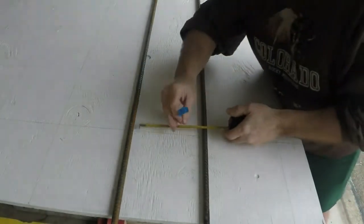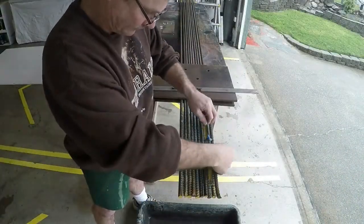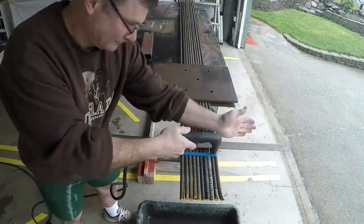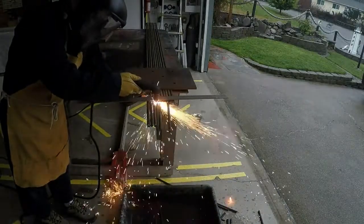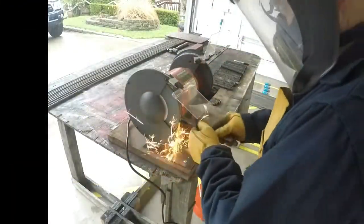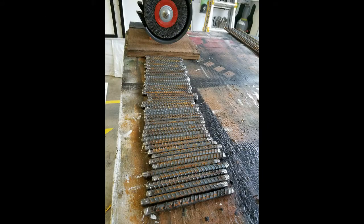It's time to cut the short rebar. Instead of actually reading the tape measure, just put a piece of tape on it where it's supposed to be — no error possible this way. Then lay out 10 sections of rebar side by side. Transfer your tape mark over the rebar, line up your straight edge for your plasma cutter, then let the sparks fly. You'll actually be surprised how quickly you can cut several hundred pieces of rebar with just compressed air and electricity. However, the next task is much slower — you need to grind and clean each end of each of the short pieces of rebar. It took me about an hour to do this many.